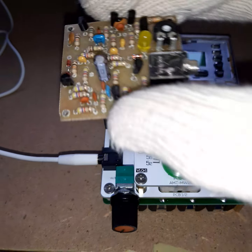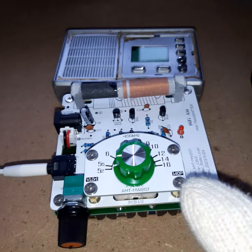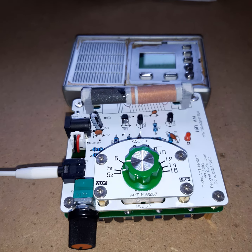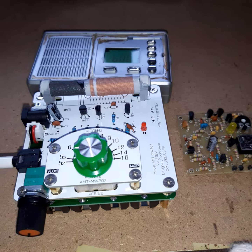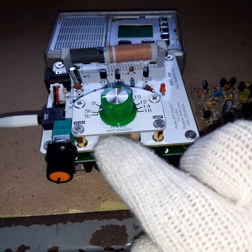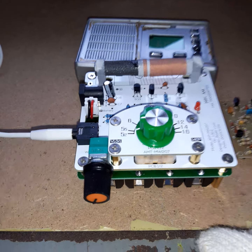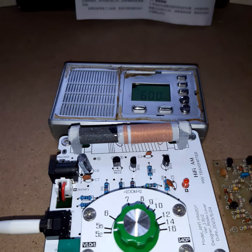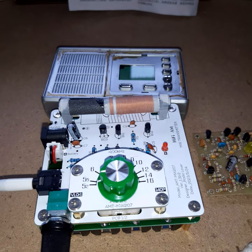I have a transmitter here. This is a very simple circuit — you can see it's much more tiny. This thing here is a transmitter from 520 kHz from the beginning of the AM band up to 1620 kHz, and if you compare the size you can see it's much smaller. It doesn't use expensive components. When I talk about expensive components, I mean this variable capacitor which has maybe 500 pF, maybe 240-something in this area, and this ferrite rod antenna is also very expensive.